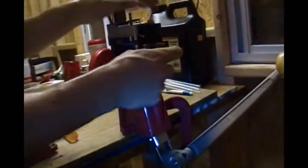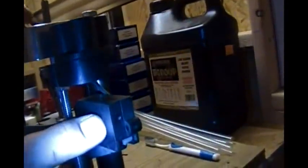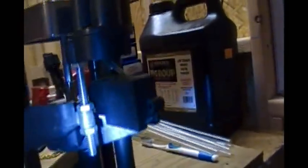First, we need to take this case feeder off. To do that, there's the Z bar — we've got to pull that out. If you look right there, you'll see the Z bar. This thing is the Z bar; this is easy to deal with. We're going to go on this side here because it's easier, and we're just going to pop it out. We'll set this aside temporarily, and then we'll just slide the Z bar out. There it is.